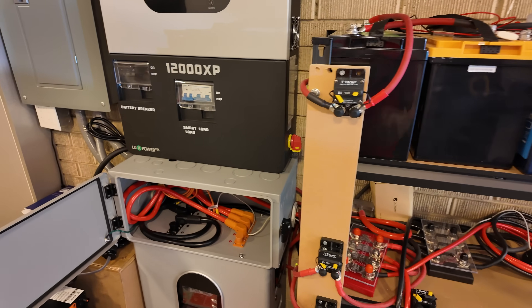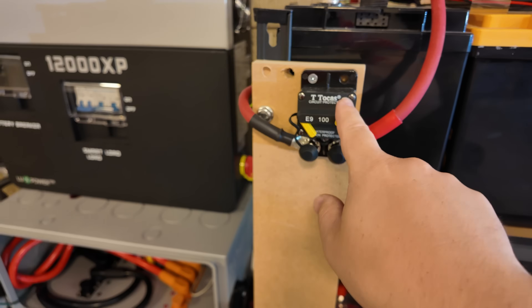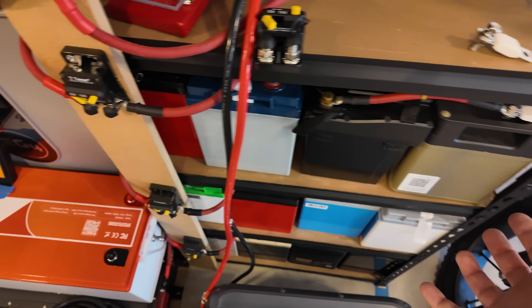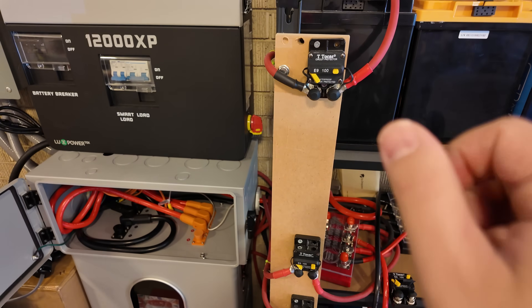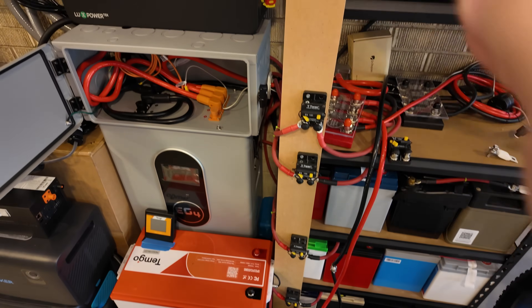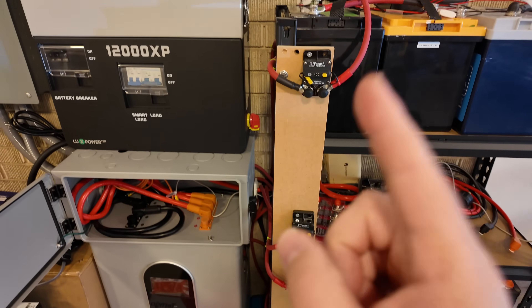It's very important to get the appropriate voltage-rated fuse for the kind of voltage you're dealing with. Remember what I said about having valves and spigots to customize the flow of water? On each string — these four batteries feed into a disconnect here — I have little breakers, which I call disconnects. They're like those spigots. They allow me to disconnect and isolate every single part of my battery bank, break it into small segments. If I have an issue with one part, I can keep it out of the mix while everything else continues to function.